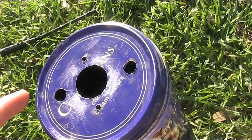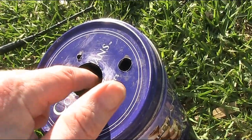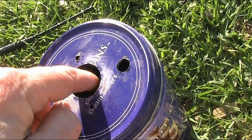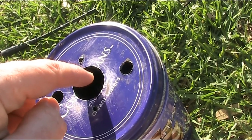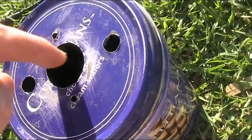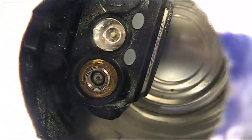We need to introduce a bit of coupling to the outside world, and that's what this hole does. Just put your finger in and it acts as an antenna. Not only that, but it's also an attenuator. The further away you move it, the less the pick-up, because there's so little capacitance. Ideally, you want your finger to be lining up with the antenna socket, which you might be able to see just inside.